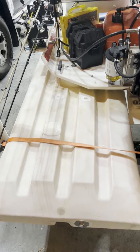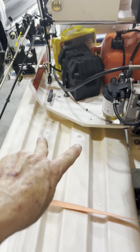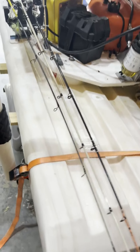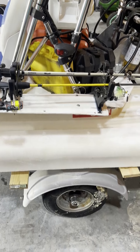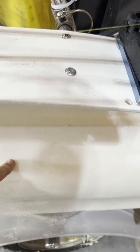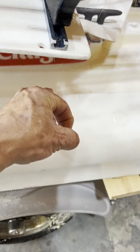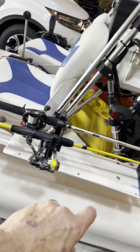I used a two-stage closed-cell foam — when you mix the two parts together and pour them in, the foam expands. That's why you see these two holes up here: they're expansion holes. If you don't have those drilled and you pour the foam in, chances are you're going to blow the pontoon out. To test where the foam was in my pontoons, I took a flashlight and held it right against the plastic all the way down. Wherever I saw a large white glow, I knew there was no foam. Where the light beam shrank up real small, I knew foam was present.